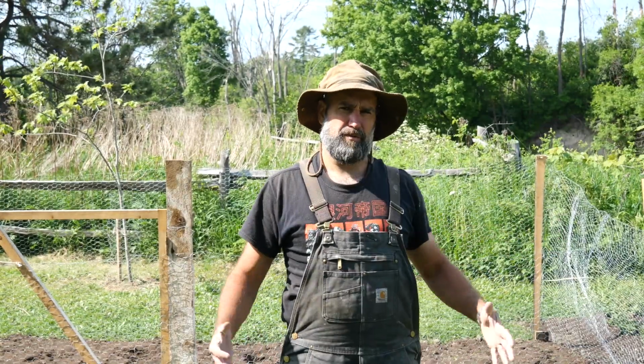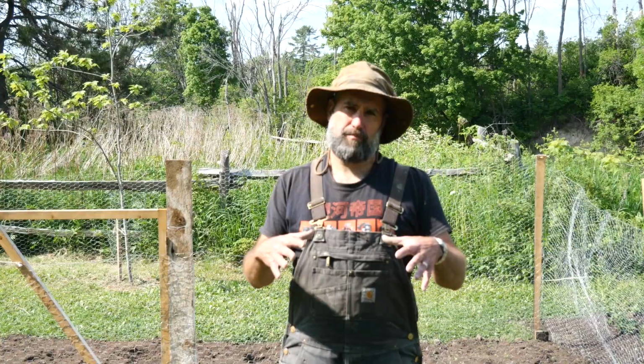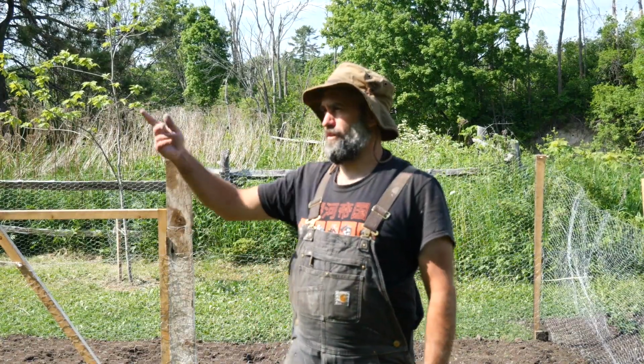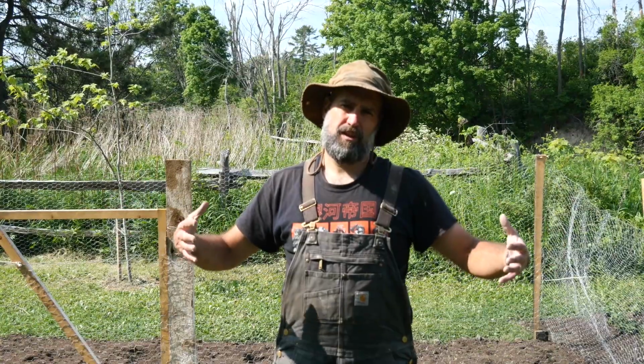But with this, all I'm doing is I've added some soil and piled it up around the greens to cover them a bit. We're going to be doing all this excavation in that. I'm going to try and be careful to remove the topsoil and set it aside so it doesn't get mixed up with all the clay and less desirable earth that's beneath when we dig that foundation.